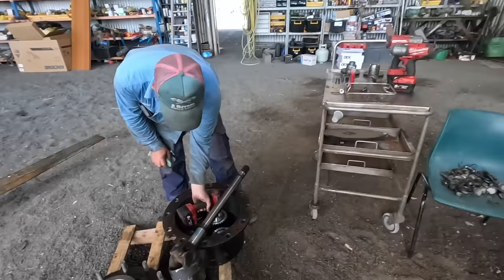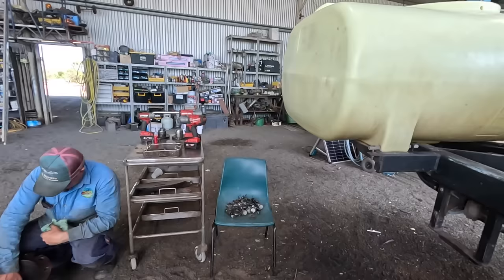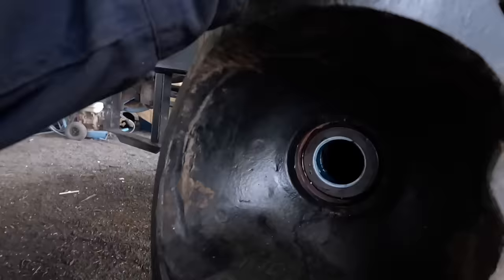One of the rollers may have fallen out while putting it together, and to get the cone back out, we had to use some pullers, and that's about the extent of that. But anyway, we got there, and I think it's good. And we saved the uni. And I got the new bush and seal in here, so that is good. And we're about to put the axle in.